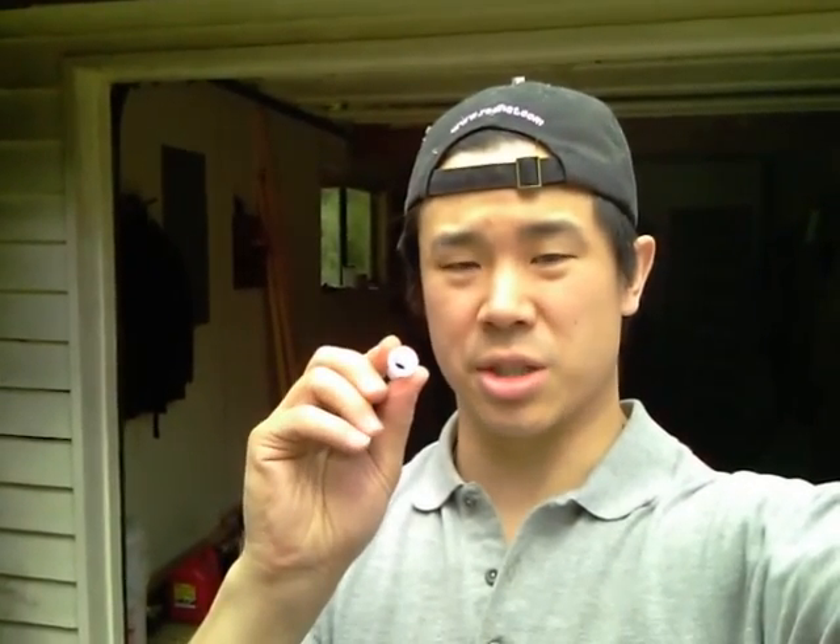One last thing before I go — there's something you've got to remember when dealing with the PEX and the Gatorbite couplings. They have a liner, this little thing here. The liner has to be put into the PEX piping before it's put into the coupling. It's pretty important so that the pipe doesn't collapse in the coupling and so that the flange is straight. Hopefully this has been helpful. Thanks for watching.